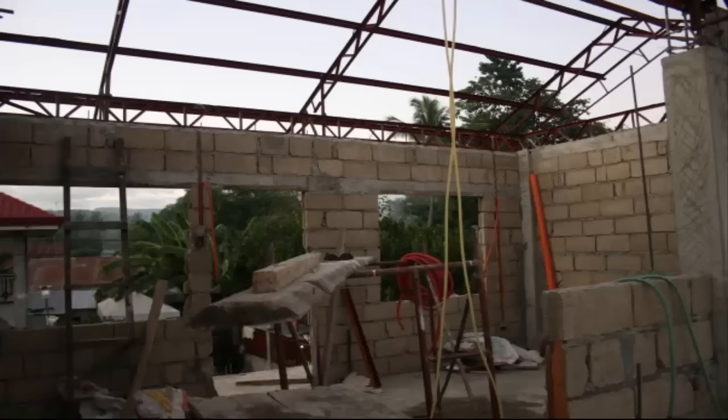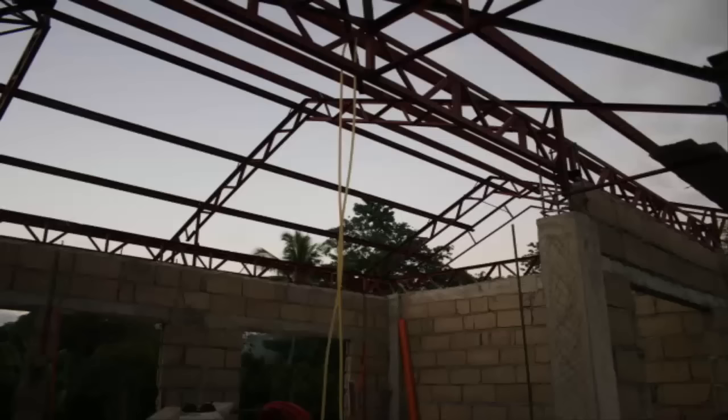You can't build hollow blocks straight up into one wall — it is not good for the hollow block and it is not good for the risk of it falling either. You are better off doing it in stages, doing it right, swapping the guys around: if they did it on the right hand side yesterday, do it on the left hand side today.